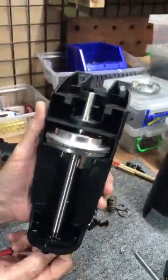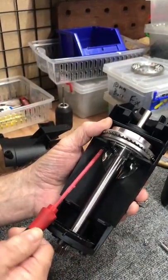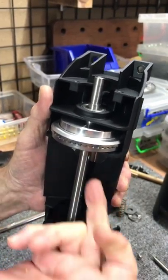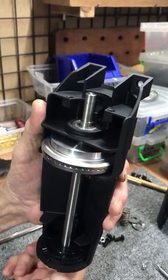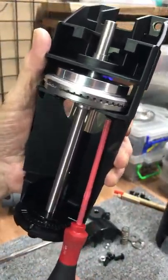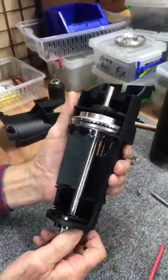Now. And the stationary burr screws are loose. So. The only place that the stationary burr can go, because of the tooth formation, in relation to the moving burr is in the right position. So these screws are loose on the fixed burr. You install my axle with the rotating burr. That's my best alignment. Meet them together and then tighten the screws on the stationary. The burrs are rubbing together. Now, in this position, I reach up here, I tighten, and I tighten. That's my alignment, a nice, smooth run, okay?